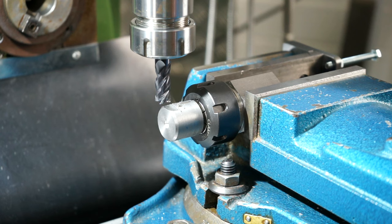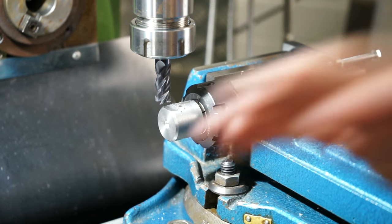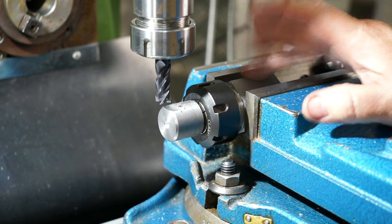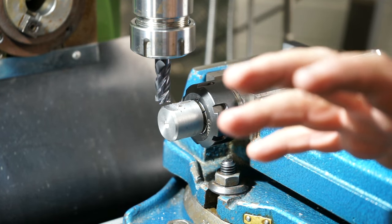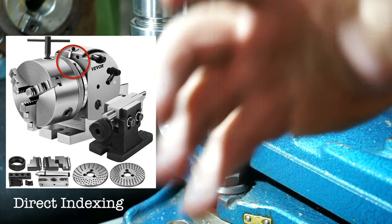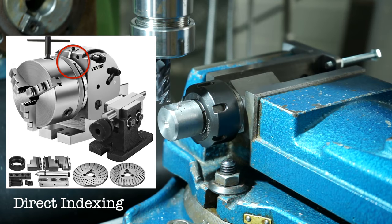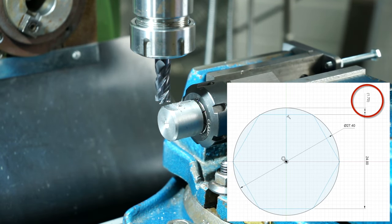I'm back in the milling machine. I was going to put the indexing head on but I'm running out of time, so I'm using a hex block. If we use the indexing head it's just for direct indexing — you use the degree wheel on the outside near the chuck. This one's simple: I'm going straight to depth 1.7mm, away we go.